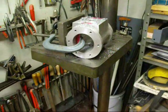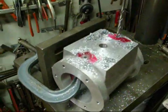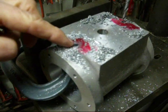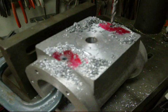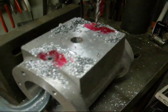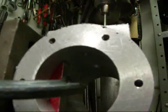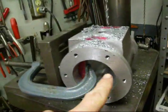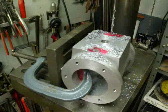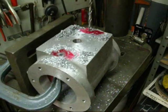One last thing on the cylinder. I just finished up drilling the two steam holes — or air holes — here on the drill press, and they're 3/16ths diameter. I may have to open those up to quarter inch or slightly larger if that isn't enough air to run the thing, and those go all the way through. I am going to hone this out just a little bit with that cylinder hone I showed you in the first video, and now I really am done with this for now. Thank you.